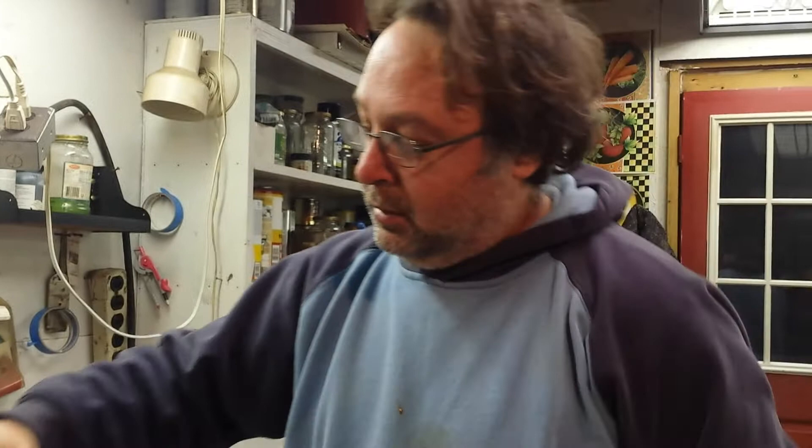So I'm sending you this glaze — it's about halfway full. The first treatment is your stain, the second treatment is your glaze, with a top coat in between. Put the stain on, clear coat it, sand it, then put the glaze on. Let the glaze dry for maybe 45 minutes to an hour, then put another couple coats of finish over the top, lightly sand it, and put a few more coats on.